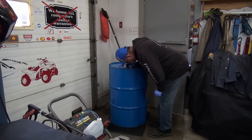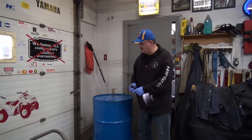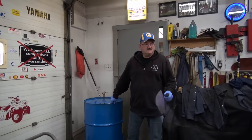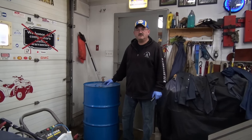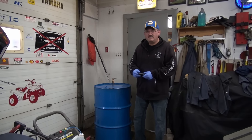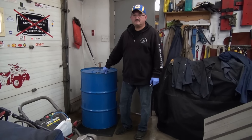So you can see the bits of fuel there folks — it's about the color of apple juice, yellowish. There's a little tiny bit of water, not much, but it's rusty. Your filter will stop the water and the sediment, but if you fill it up that rust is not going to get any better. You're liable to come out some morning and see diesel fuel across the floor, and that stuff doesn't smell real nice — plus it's an environmental hazard.